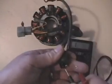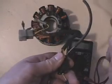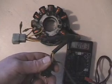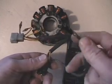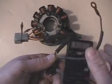You can also check your ground. Whenever I get a unit in to rewind, I check all of these and just check continuity to the ground. Usually if the ground's broke, it's out here by the eyelet somewhere. Once again, very low — 0.3 to 0.4 ohms — and that's what it's supposed to be. But usually if it's broke, it'll be in the eyelet area in that connector. So always check that.